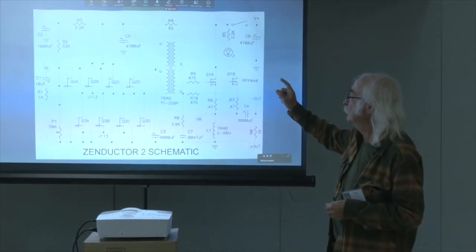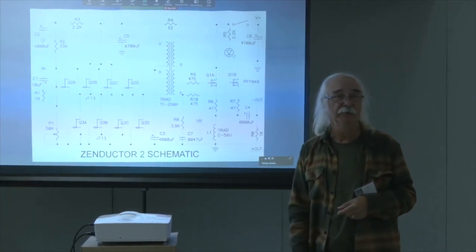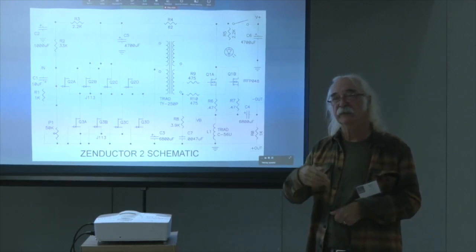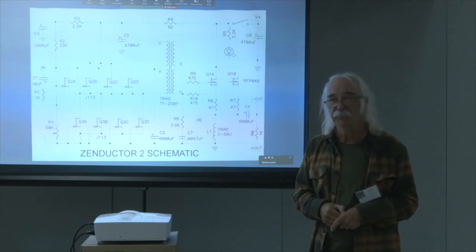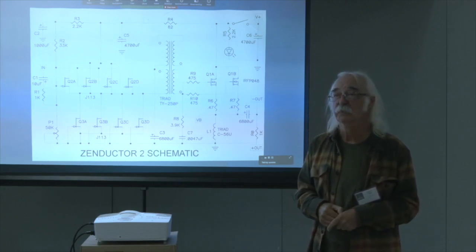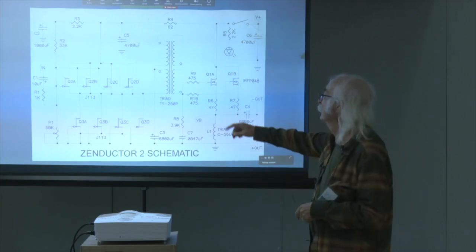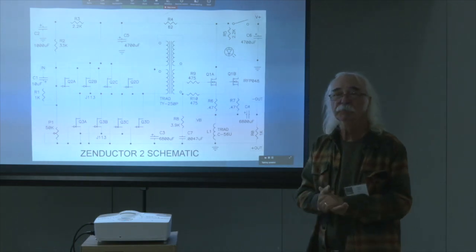The voltage gain comes from a little transformer that costs about $7. That is the primary feature of that part, because the next step up in the marketplace costs about 5 to 6 times as much. So the decision was made, well, let's just go with the little Triad single transformer here. And we use it for voltage gain.